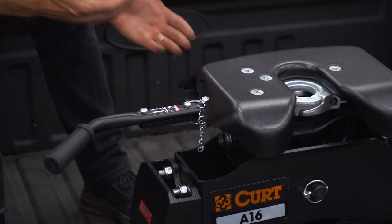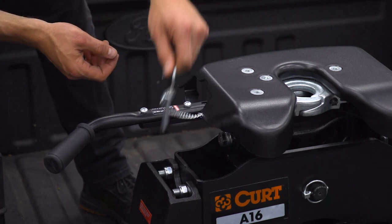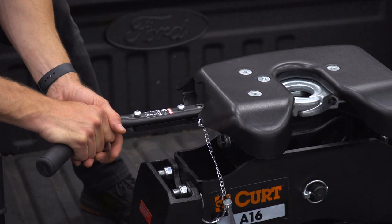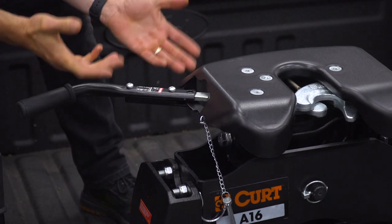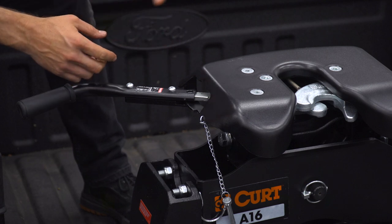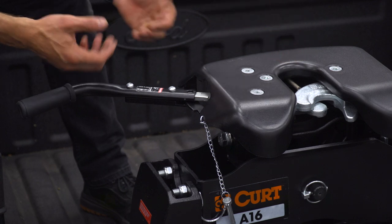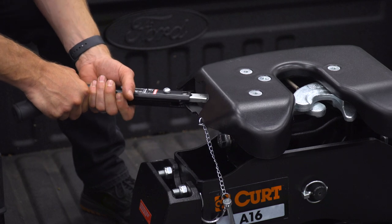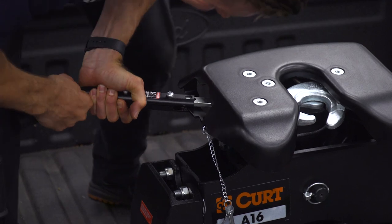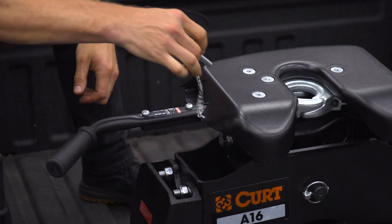To prepare the head for coupling, remove the pin — that allows you to pull the handle out and slide back. Be careful, this is spring-loaded. At this point you are ready to couple. Coupling itself should lock the jaws around your kingpin, but if not, you can do it by hand: pull out the handle — this takes some effort — then push forward to lock the jaws back into place. Secure with your pin.